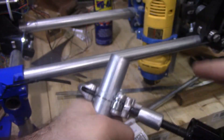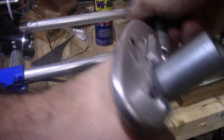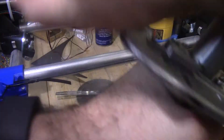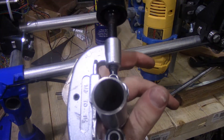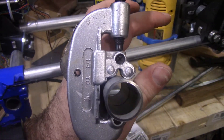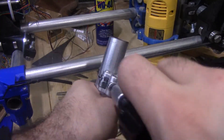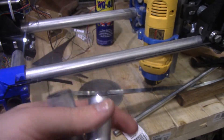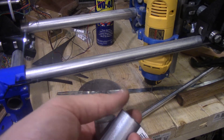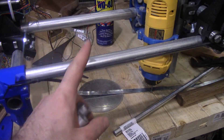Does this have downsides? Yeah. I do now need to buy a new one of these or a new cutter — probably a whole new thing because I had to hit it with a hammer a few times because I did some things I shouldn't have, and it no longer was cutting anywhere near straight. Don't over-torque these things. But you can see there's a line showing up in the center. It is working — it's deforming the metal instead of really cutting it. And there it goes, it just cut. That will give you a darn near square cut, almost exactly square, right on your pencil mark for the length. It works for every single cut on this thing.